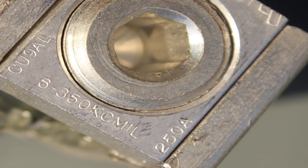While we're talking about lugs, if you go back to the lug that had the printing on it, there are occasions when you're also going to see that a lug that's listed or rated for multiple conductors will actually tell you on the lug that it is. We have all these things we're talking about, like you can't put two wires under a lug. That's one other marking that you'll see on a lug, and we probably need to get a picture of one of those.